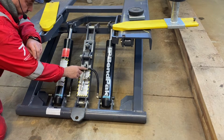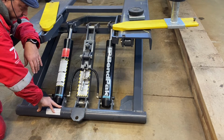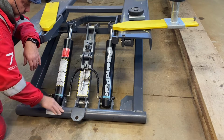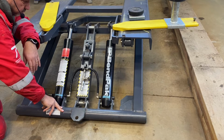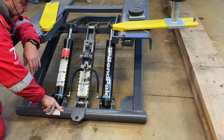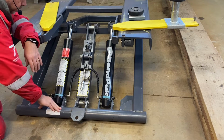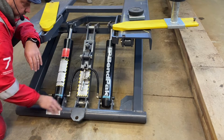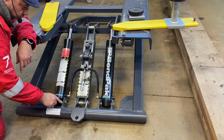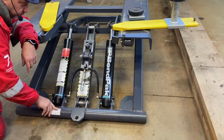These are all proper hydraulic fittings. These are stainless, just because I have stainless. They're designed and meant for up to 3,000 psi and up to 6,000 psi dynamic, so that's not a problem. And I've protected these hoses, in case I'm doing any welding or grinding, with a bit of spiral wrap. I've also put it on the actual hose that comes from here. It's got a QD 90 degree, and then the hose goes to the control unit.